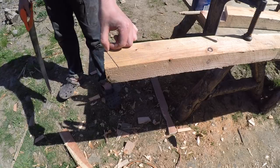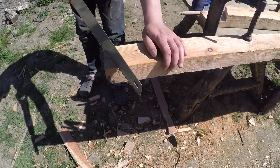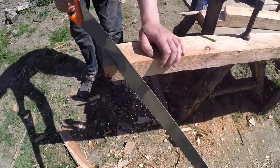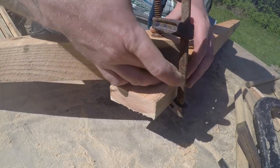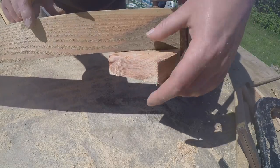That line there is gonna be a joint. If we wanted to get this really nice tight joint, you'd score that with a marking knife first, but it's gonna be close enough for a building. There we go, clamped together. You see what I meant by leaving this bit long — there was no point in really working out the angles. I can just leave it long, cut it off flush, and it'll be nice and tight then. No messing around. Doesn't matter if we leave that long in this situation, it's not gonna be a problem.